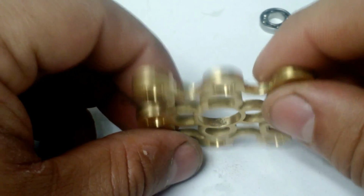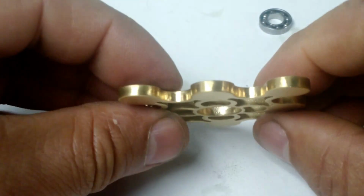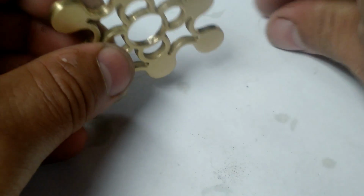Now on the 9 gears, because they're so expensive, I really pay attention to this very, very carefully. Since I'm assembling and rejecting parts as I'm assembling, I usually catch this very easily, so it never goes out. So there it is. You can see, file those two little spots, and like I said, it doesn't take much. You can see there's the metal there. That's it, just that small amount.